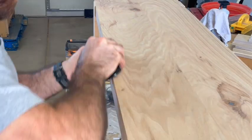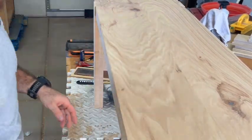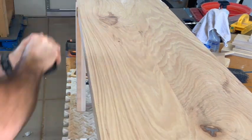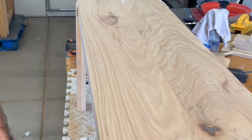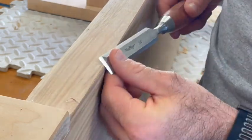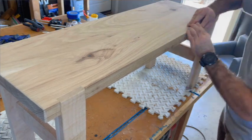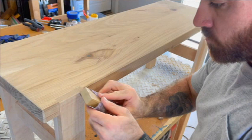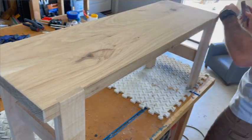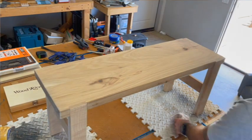For the edge profile I wanted to do something interesting. It originally started off as just giving a chamfer to the bottom part of the legs, then I started thinking about it and wanted a chamfer on the whole piece. But I didn't want a perfect 45 — I wanted that chamfer to be facing more toward the top so the light would catch it and when you come into my house you can actually see the edge profile. Because I did this after the glue up, I just had to fix some of those hard to reach places with the hand chisel, then cleaned up the edge profile to make it not as sharp — especially since I have small kids.